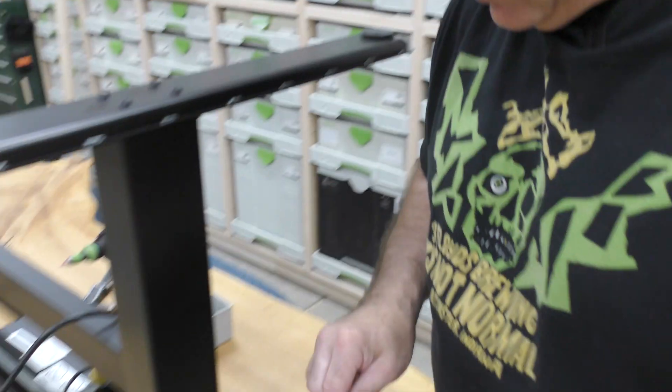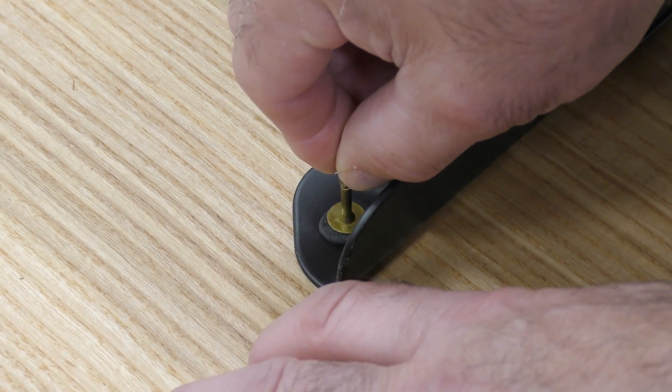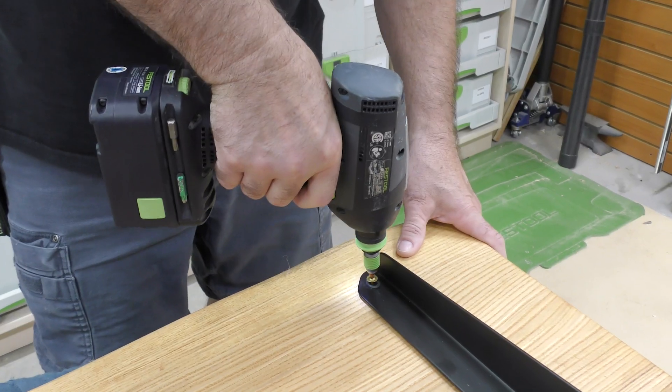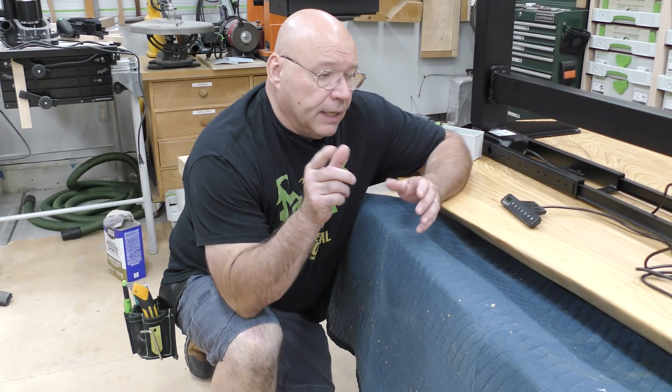If you're doing your own desktop, make sure and check these at the hardware store: I want a washer head which will pull it tight to the desktop. If you don't have a self-tapping screw and impact driver, make sure you pre-drill and set your drill depth properly — you don't want to go through. I always eyeball it too: I know this is 50 mm but I'll hold the screw against the slab — I know I won't punch through. I've got seven millimeters of clearance.